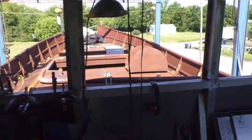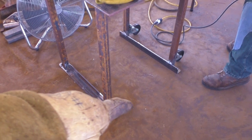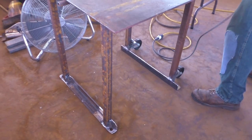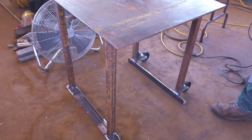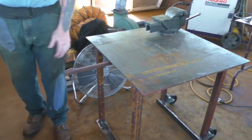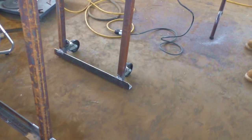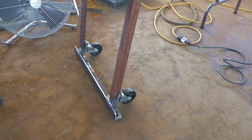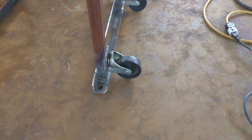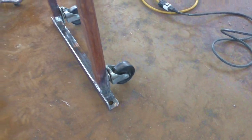Let's show you what they've been doing. We built this little table yesterday, and it's designed to go on the boat — because we have on the bottom of it holes for three-quarter-inch bolts at a two-foot center square, so it can be bolted down anywhere below. We're also going to put the same bolt pattern on the boat. It's got wheels on the other side that are only in contact when the table's tilted — they were swivel wheels, but the weld took care of that. Those wheels are touching the ground but not really resting on it. They're about an eighth inch.